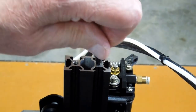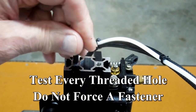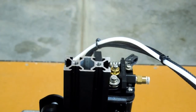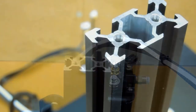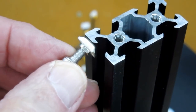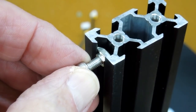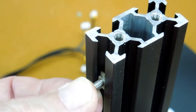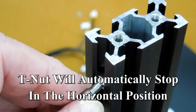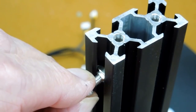It's always a good idea to take your fastener and see if it wants to go in freely before you start assembling. Make sure there are no burrs so you don't damage the threads. What they're showing in the diagram with the T-nuts: properly installed, the T-nut should be horizontal across that channel. You can either slide it in or stick it in — as long as it's still loose it'll turn. Properly installed it should be horizontal; any other orientation is incorrect.